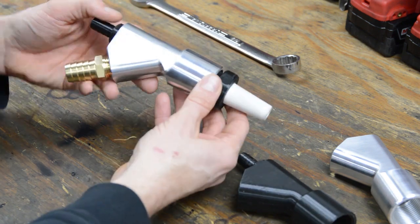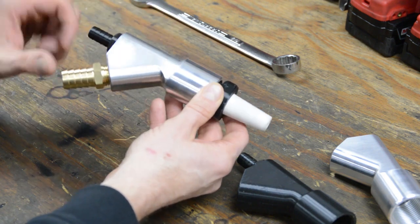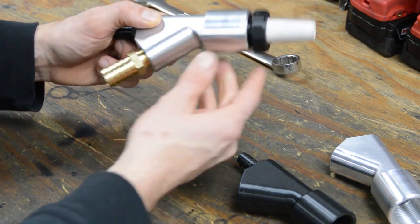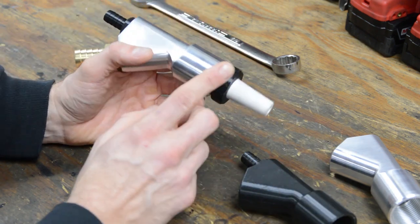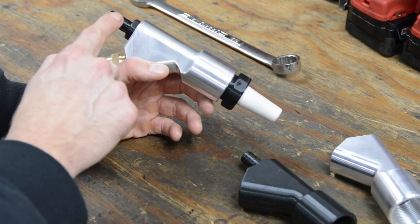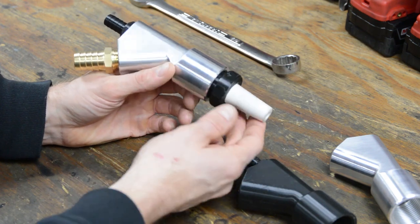The only change he's going to do is probably radius this a little more, and then sink this fitting into the body about a thread and a half — see how it's sticking out a little bit? That's super easy stuff. I ordered nozzles; I have a whole bunch of them. This part and this part is on order — they're making the full batch and it should be available the first week of February.